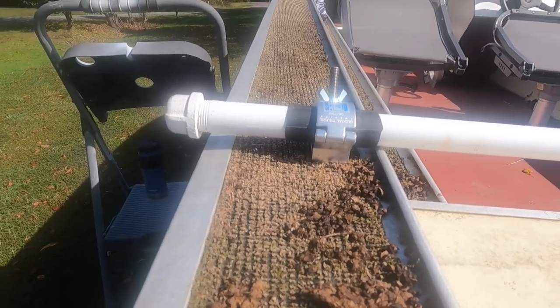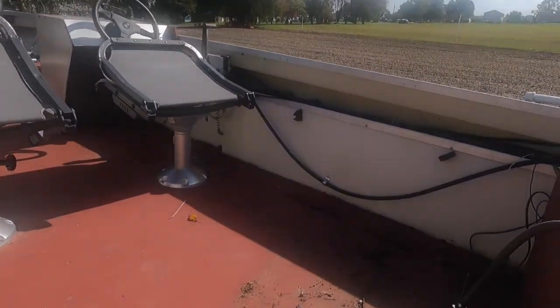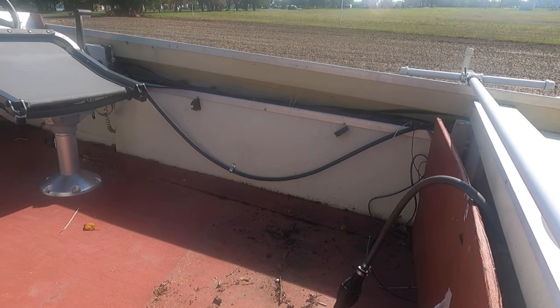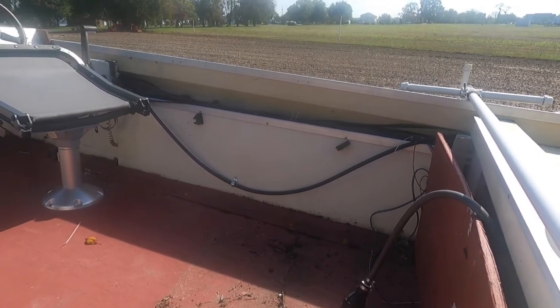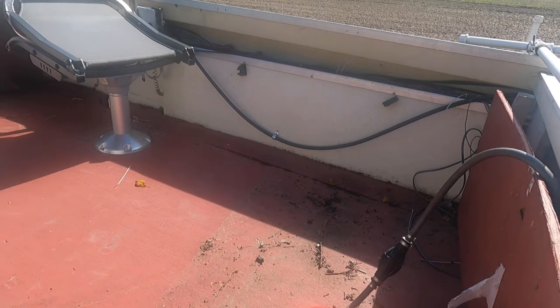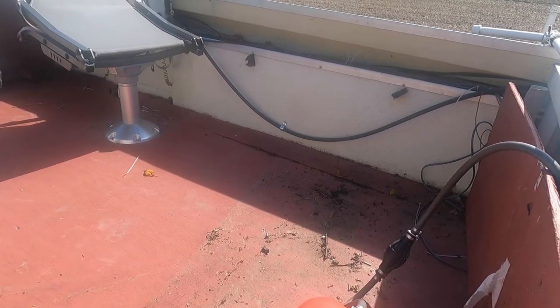There's the other side of the boat where I can just undo it. I also put in a new steering cable. The instructions said to measure the length of the cable, add a foot, and round off to the nearest foot — so I did that and ended up with about an eight-inch loop, but no big deal.